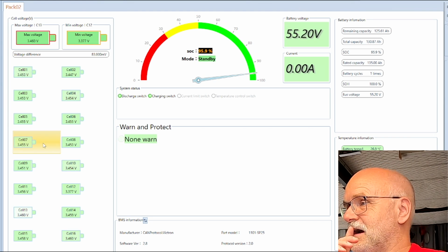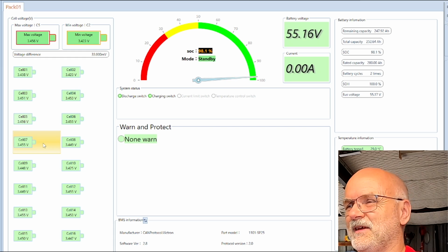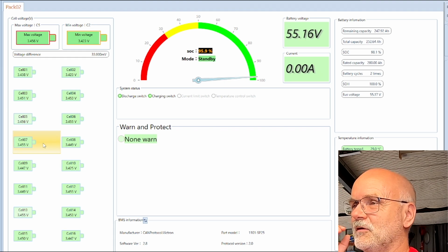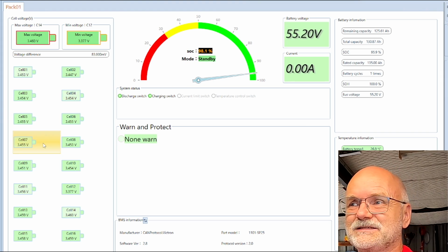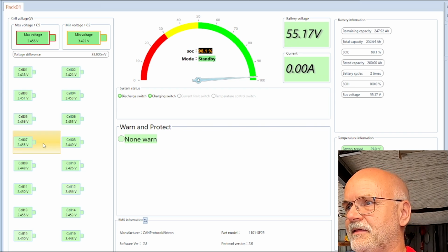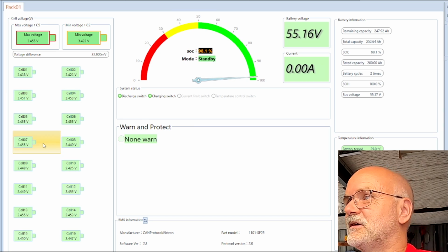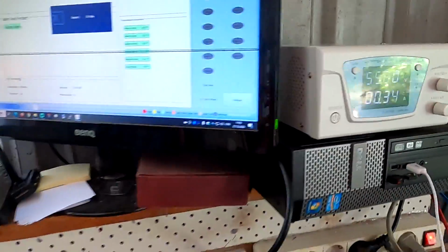So it is now 10:50 a.m. in the morning, and I want to discharge this one into the Tesla as well. So, and the test may take 7, 8, 9 hours or so. So I want to start as early as possible with that, but I'm happy to give this another half an hour now to see if the balancer actually comes down, but I honestly cannot see that happening. Okay, let's wait until 11:30 and then we start the test and discharge this battery. This balancer is really the weakest point of these BMSs. So we are still charging with 340 milliamps into the batteries.